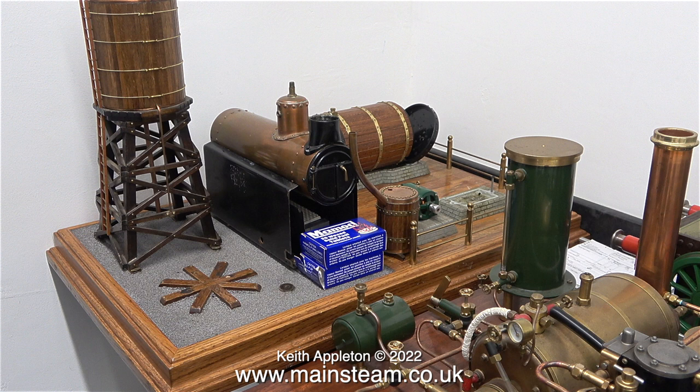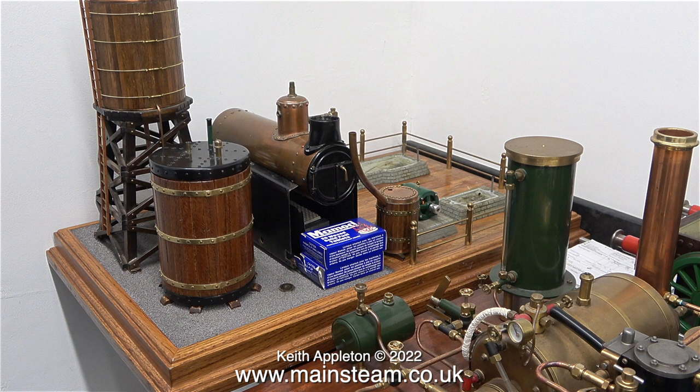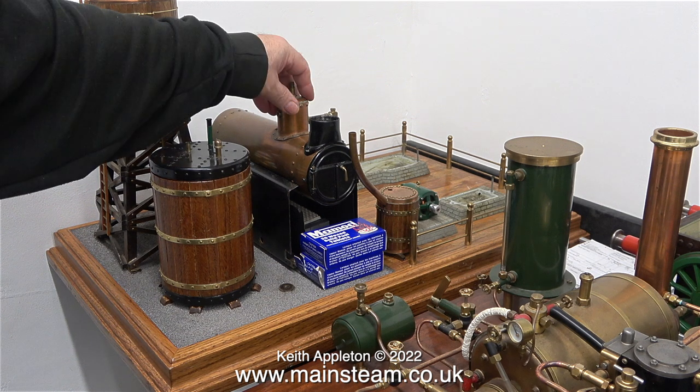It's a fire tube boiler, designed to be fired from the other end of it, but this one's fired from a gas burner underneath. The same customer sent me a complete set of parts for another PM Research boiler, pretty much like this one. Maybe I should have a look at the drawing for that other boiler to see what the firing arrangement is. It doesn't really matter though. The best thing about this steam plant, in my opinion, apart from the water tower, is the baseboard.